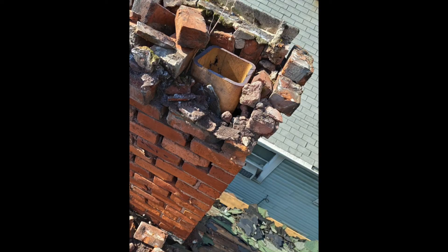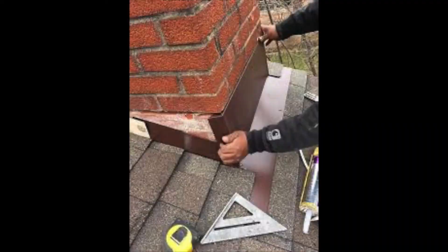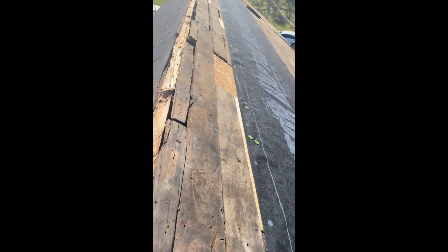Then you install the drip edge. Now, some roofs like this have old chimneys that are falling apart. You can do one of two things: if the chimney doesn't have anything venting through it like an old fireplace, you can simply demo it. Or you can tuck point it, wrap it with mortar, and put a chimney cap on top to keep out squirrels, birds, or raccoons. Next, put the flashing around the chimney, and once we do that, we want it to look like this.